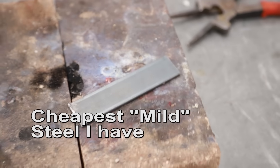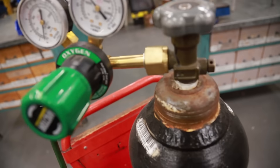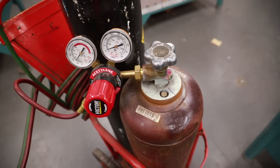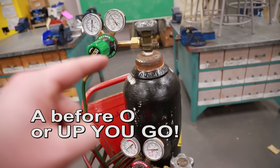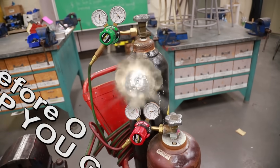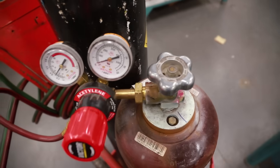This is just regular steel. When setting up your tanks, we've got two here — an oxygen tank and an acetylene tank. I have a little rhyme that I follow for all of these steps: it's always going to be A before O, acetylene before oxygen, or up you go. It's going to help you remember every single step.